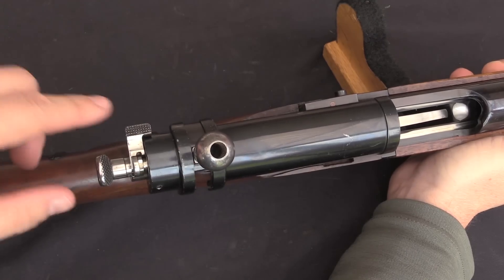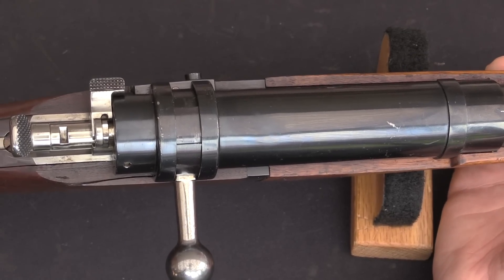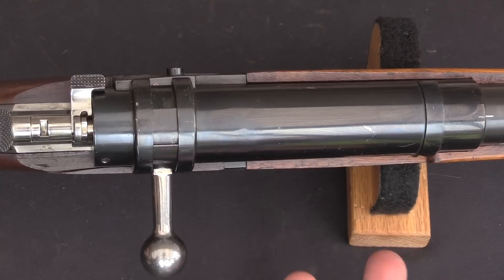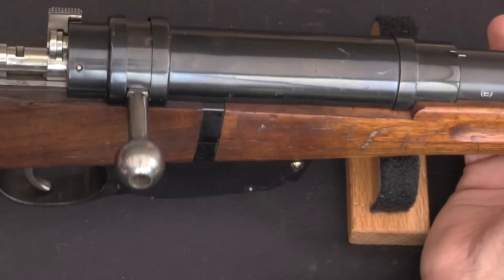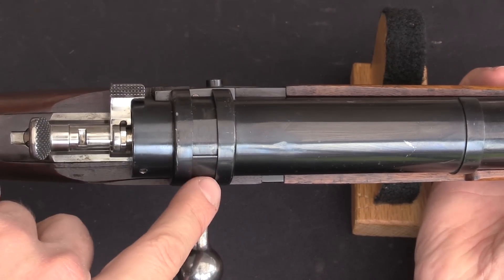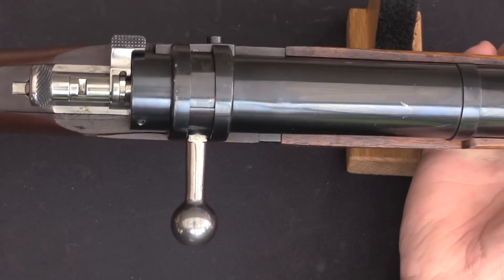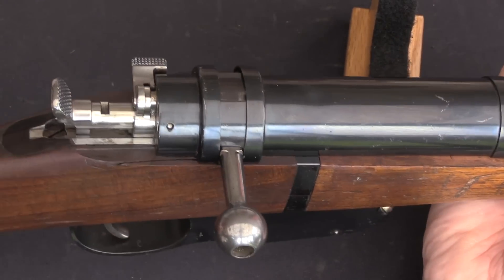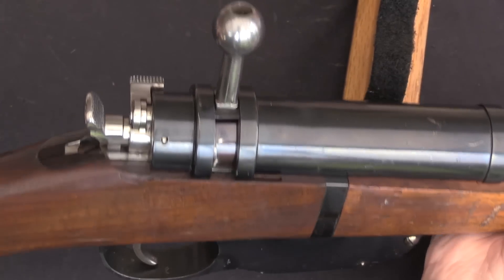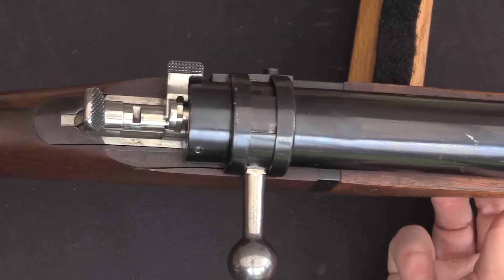The bolt handle is hollow for weight reduction, and it's got some nice checkering on the safety as well as the cocking piece. This rifle was actually the subject of two patents by none other than Rudolf von Frommer. One is a mechanism in the front that prevents you from cocking the rifle without the bolt head — kind of a redundant, self-solving problem. The more interesting patent is on the sliding metal pieces in the dust cover. With a turn bolt system you have to have space to lift the bolt handle to unlock the action, and this dust cover completely seals off any opening by having a couple of interlocking metal pieces that overlap and slide together so that you can open the action. That patent was filed in Hungary in 1933 and Austria in 1934.